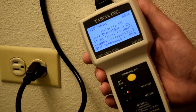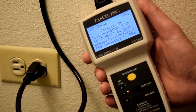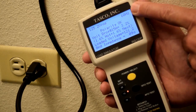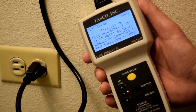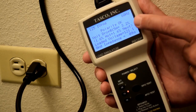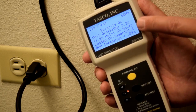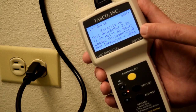The inspector is telling us we have 125 volts true RMS. It's a 60 cycle line. Polarity is correct and we have a 3.2% voltage drop — 1.6% on the hot and 1.6% on the neutral. Loaded voltage is 121.1 with 0.09 ohms of ground impedance.